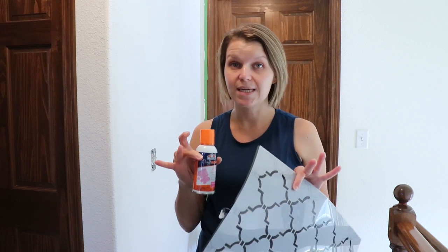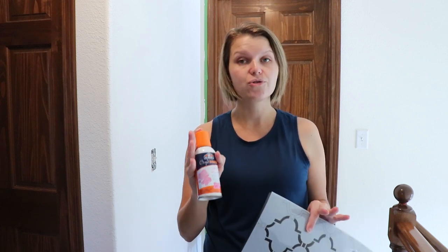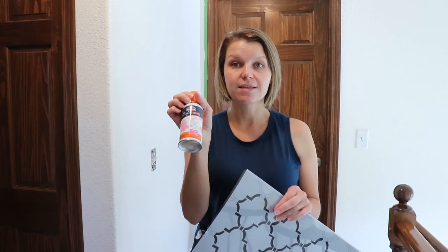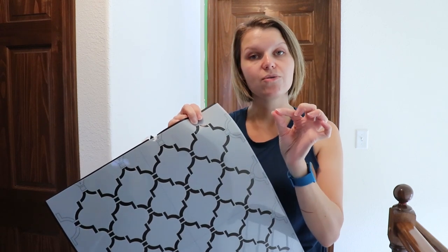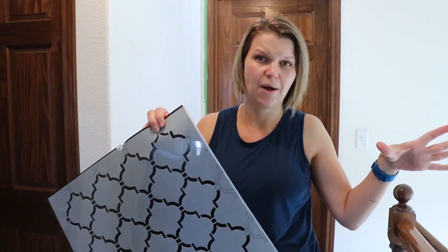Today I'm going to show you a really easy and inexpensive technique. This is spray adhesive and it can be permanent or temporary. To make a temporary adhesive, what you do is spray it on the back of your stencil and let it dry for a few minutes. This is going to let the glue dry but leave it a little bit tacky — just enough to get it to stick to the wall so that you can paint. What using a stencil adhesive or spray bond like this does is create a really good bond so that the paint isn't going to seep through the stencil and bleed out onto your wall.